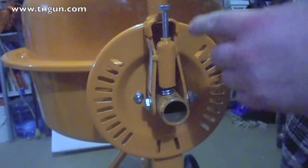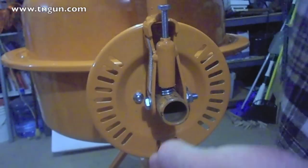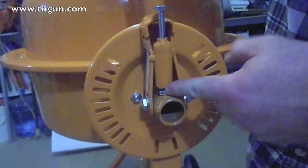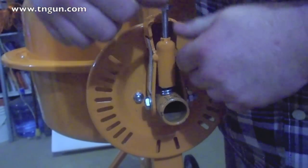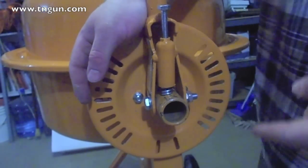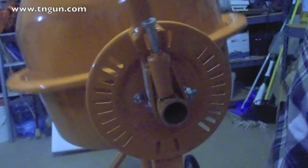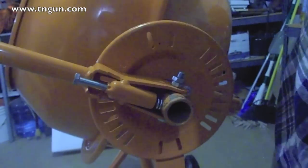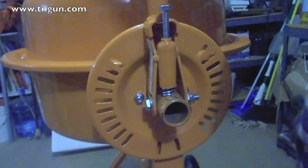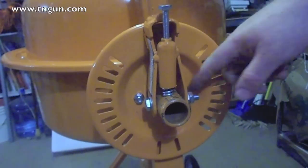Then we got this handle. Well, this handle's got this bolt that came already screwed in it. There's a little metal, almost like a little dime, that goes in here. And then there's one spring, that spring fits up. And what that dime does is lets this screw tighten the tension on this spring, okay? Because the spring meshes with this wheel to hold your bucket in place, right? Okay, then it just bolt washer all the way through, and then they've got two nuts.